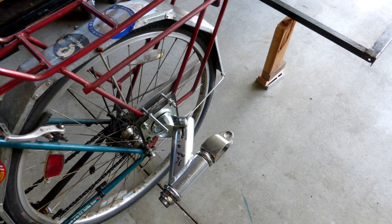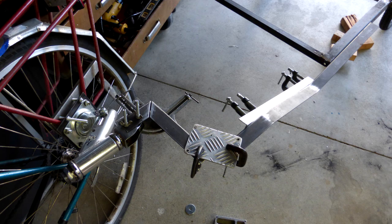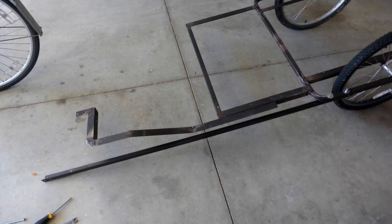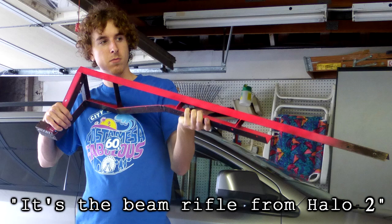Next is the linkage between the trailer hitch and the trailer itself. I didn't really know what to do, so I just started by lining up the trailer behind the bike level, and then working backwards from there. I realized this linkage would have to increase in elevation, and bend over to the right slightly to meet with the trailer hitch. I began by bolting one of those angle pieces onto the trailer, and then cutting it and bending it to fit the shape that was needed. Once all the welding was done, I took it for an initial test ride, and I realized quickly that this linkage was way too flimsy, as it would flex a lot while riding. So I bolted another angle piece on and reinforced it, thus making one of the heaviest components of the trailer.